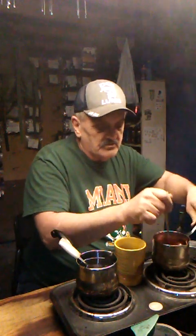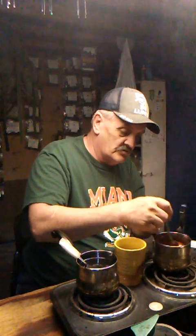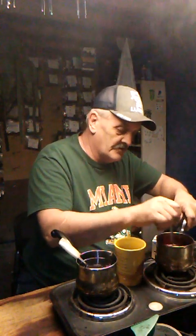Now, if you were doing it like I'm doing, you can pour the black and shoot the red. It doesn't matter what color you shoot and what color you hand pour. It won't matter. As a matter of fact, on the next one, I'll pour the black. To do it how I'm doing it, you only want to put about a cup of plastic into this two-cup holder, because this little thing will hold right at about two cups of plastic.